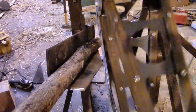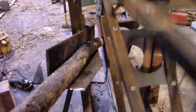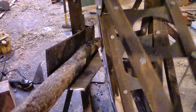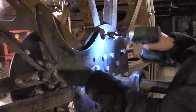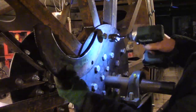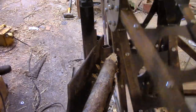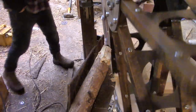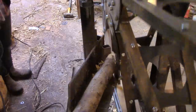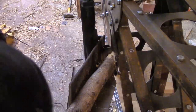That was a bit gentle. It's not grabbing - it's the angle of the bevel on the blade. So I reground the blade and installed it the other way around so it's more like a sickle shape. That showed much more promise. Of course this is just an experimental bodge-up to see what will happen. But the trouble is when it gets to a narrow bit, it gets stuck - it wedges itself between the frame and the blade. So that's not going to work.